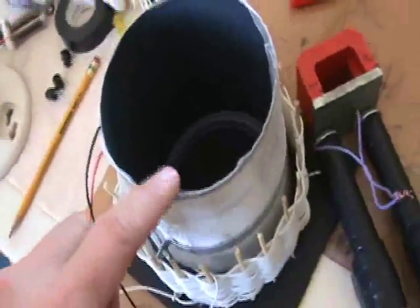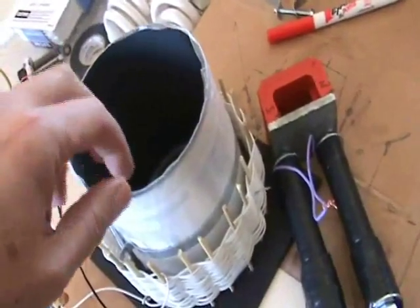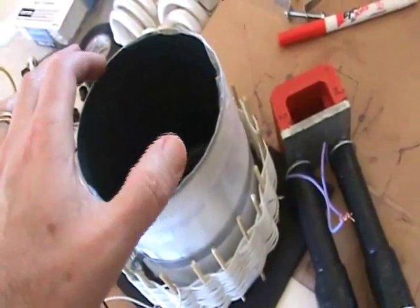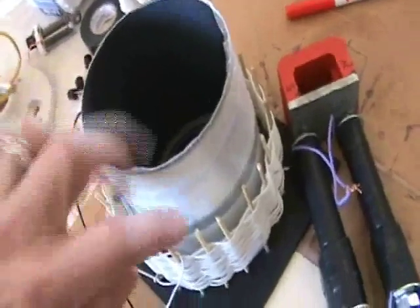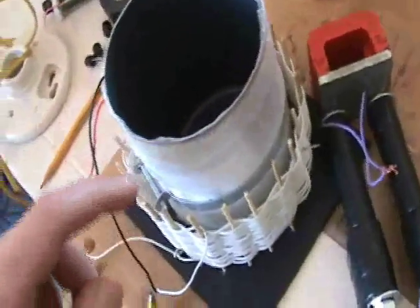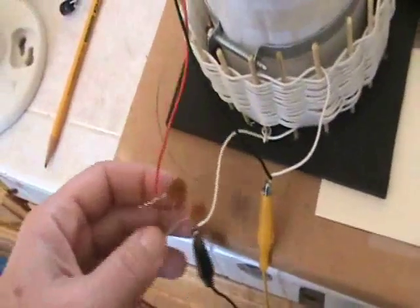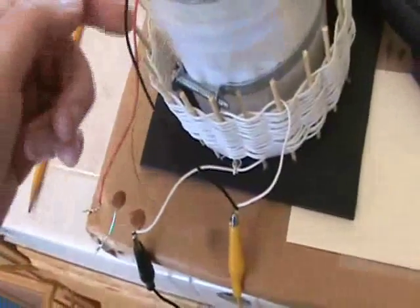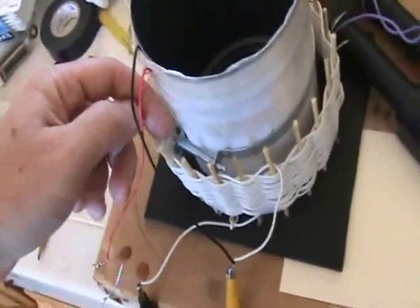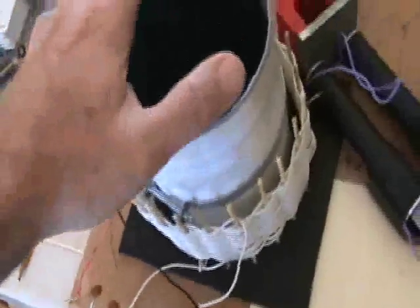The harder thing is the capacitor. I wrapped it around a smaller paint can — this paint can is four and a quarter inches in diameter. There's a handmade capacitor wrapped around it. The capacitance was too high; I'm shooting for 7.8 nanofarads, so I had to augment it with two 20 nanofarad capacitors in series, and then dialing in 7.8 nanofarads I was able to hit that exactly.